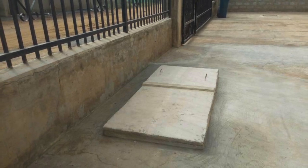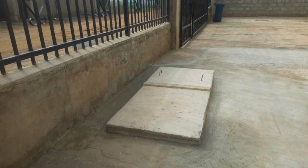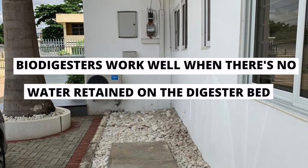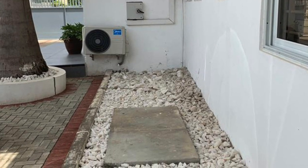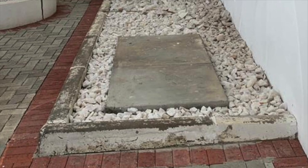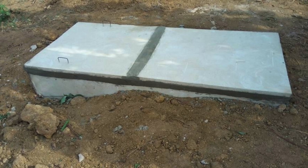A key thing homeowners need to know is that when using a biodigester, there should be no water in the digester bed — it works best when dry, and the microorganisms work best without water. That's why, as explained in a previous video, there must be rapid separation of solid waste from water. The solid waste stays in the digester for microorganisms to work on, while the water goes through the leachate pipe into the soak away, soak hole pit, or whatever water treatment system is being used. If that separation is not working, maintenance is required.